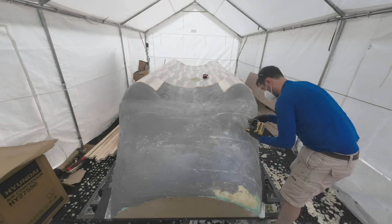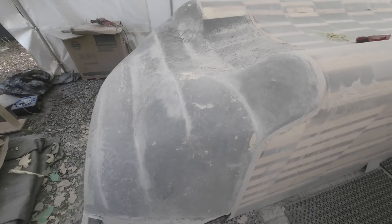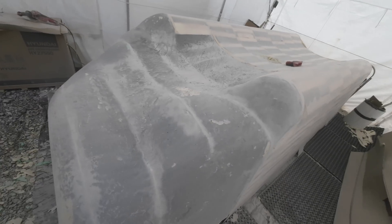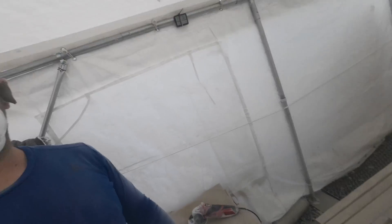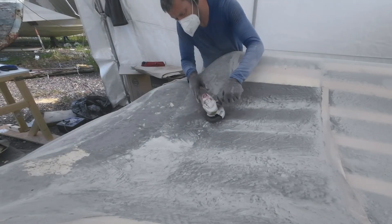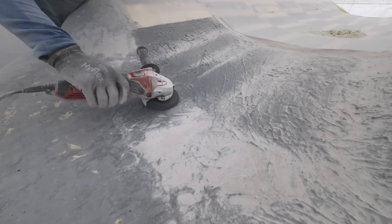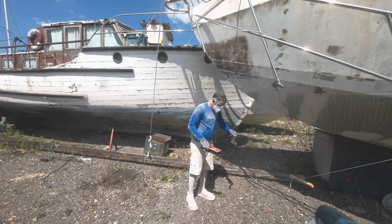I committed to this polypropylene plan a long time ago. It's pretty good, just not perfect. Maybe in hindsight I would have gone for thicker polypropylene, but I don't think I ever would have skinned the whole thing in resin because getting that perfectly flat down here would be a real problem. I think this was the right solution, but there's been more preparation work than I was expecting. By done I mean deploying the grinder — this is to take off any high points or areas totally out of shape. I'm still using the MDF former guides to make sure the nose remains symmetrical and true. It's quite dusty in here — my entire body has changed colour.